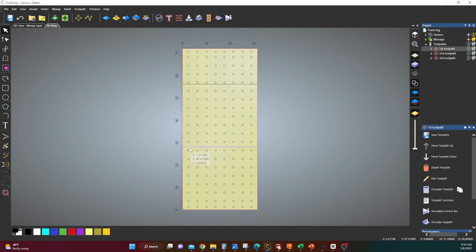And so I get my design done, and then I'm going to separate this out into cuts that will actually fit on my CNC. So you'll see cut 1, I made this box 28 inches deep, so give myself a little play. My CNC will cut at 32 inches. So I did cut 1, I did cut 2, and I did cut 3. So I separate these out, and really that's all there is to it from this perspective.